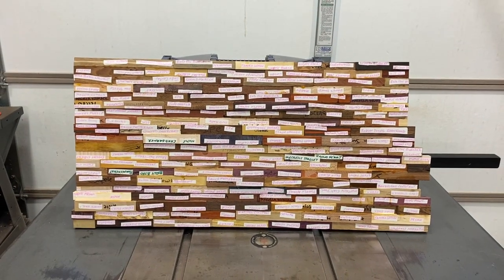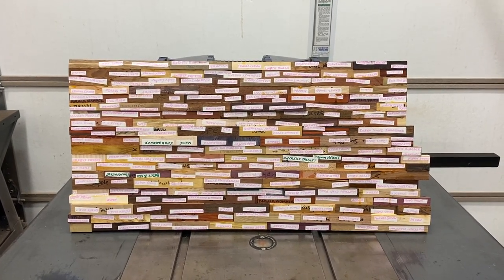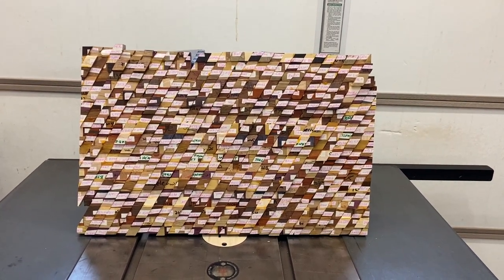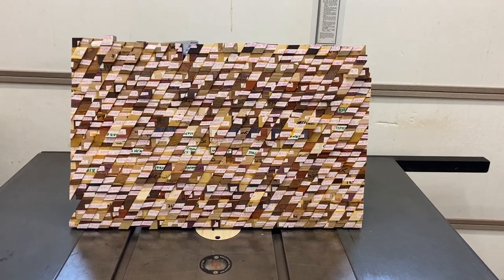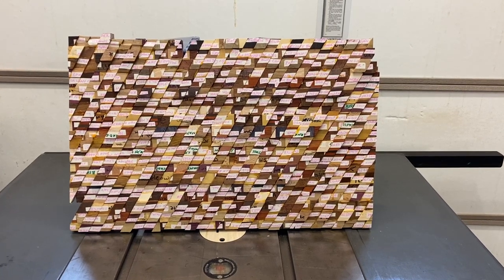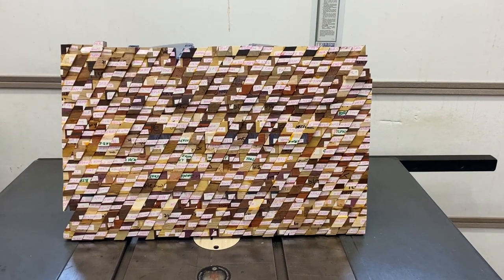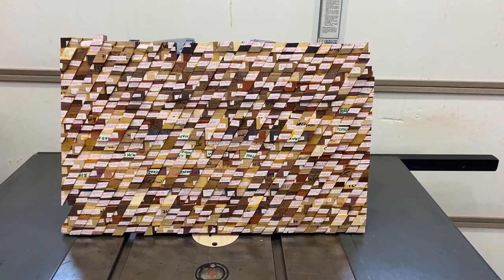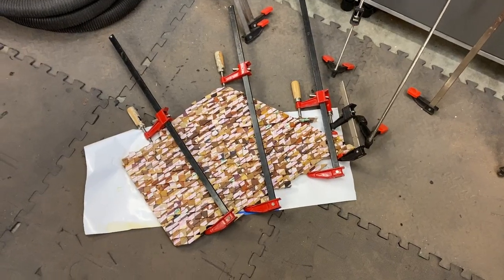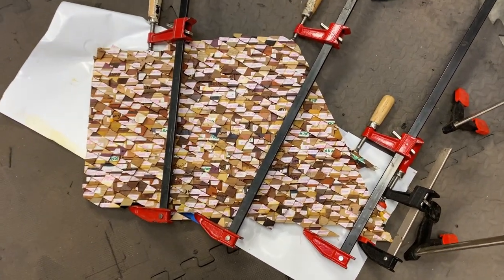We are ready to begin cutting our first set of 30-degree angles on your blank. I wanted to give everybody a quick shot of this Chaos blank. I just completed glue ups after the first 30-degree cuts. As soon as I finish this little video clip, we're going to put it back on the table saw and make our second set of 30-degree cuts in the opposite direction. We'll begin glue up, and the hope is I can start cutting this into blanks tomorrow. To all of my Chaos 2 collaboration friends who've been waiting on their blank, you're one step closer.